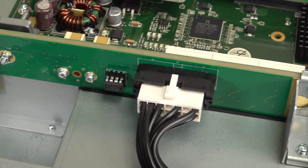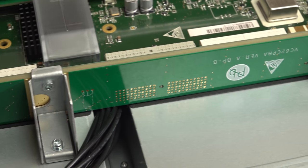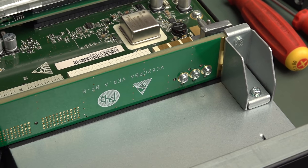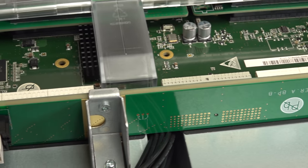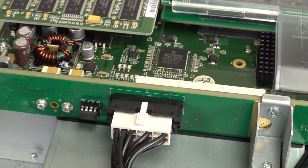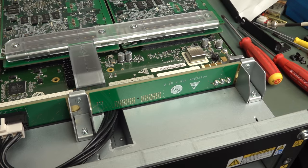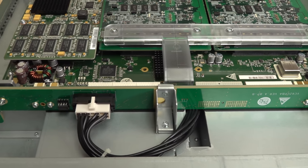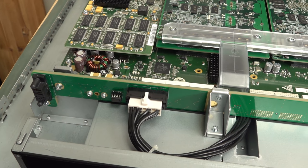Anyway, they're clearly going to be using multiple internal layers, probably 2 ounce or even more copper inside there just to get the power distribution. And of course you use the 4.2 millimeters for rigidity as well. It's not like it has to be that thick to carry the current. They're using it as a rigid structure there. Brilliant. Because we saw before 15 amps per power supply, so 30 amps total. So it's large current, but not absolutely enormous in the scheme of things.